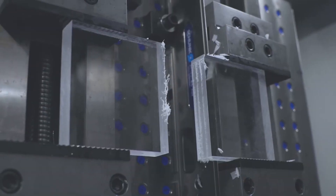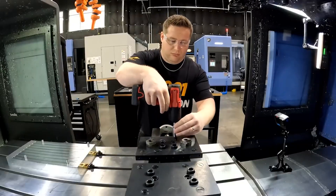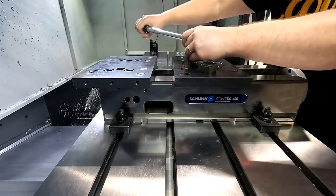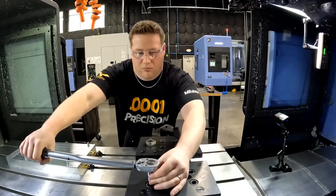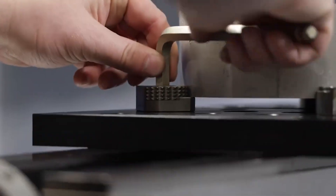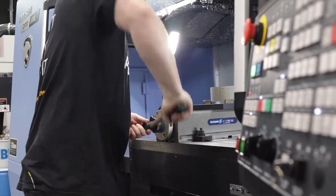To make things even worse, I found out that the manufacturing process they use to make the material is actually determined by the tolerances you need to hold on the finished part. This material is not cast — it's actually pressed. If you only need to hit, say, plus or minus five thousandths, they may press it with low tonnage at room temperature for a set amount of time. But if you need plus or minus one thou, they may heat the press to a certain temperature, put more pressure on it, and increase the time under pressure. After that, they may even go ahead and stress relieve the raw stock.